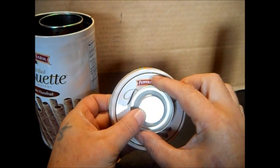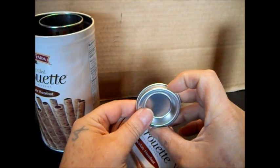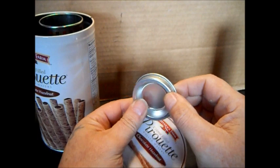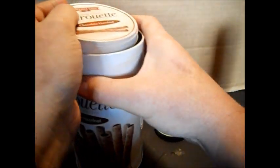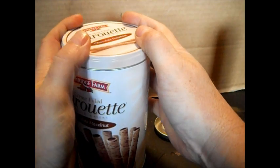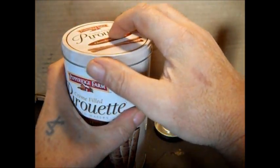There are several ways I make patterns on stuff. I will just draw this on paper. I will take my compass, do the measuring, and make it so it's this diameter so the lip will stick over — so that will be a nice, clean fit going to the lid. So when the lid goes on, it may not go on all the way, but you won't notice it. Because this can does stick out a small amount.